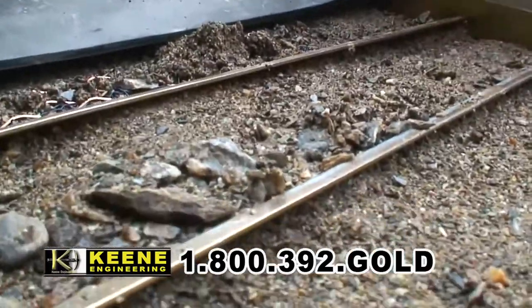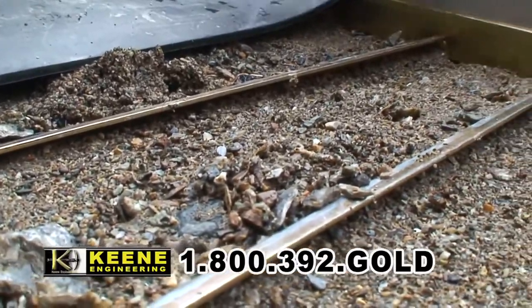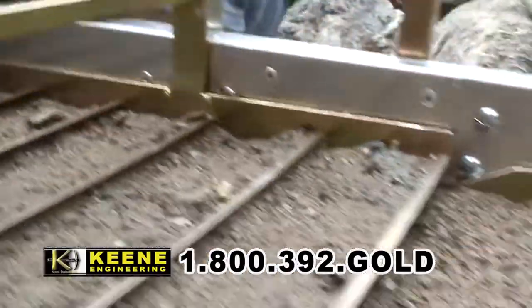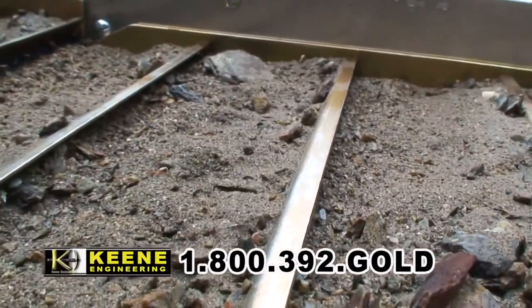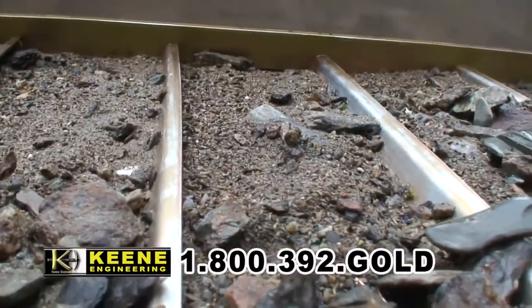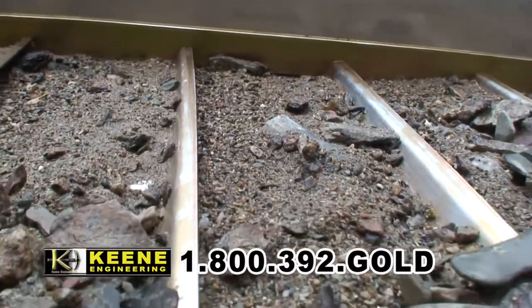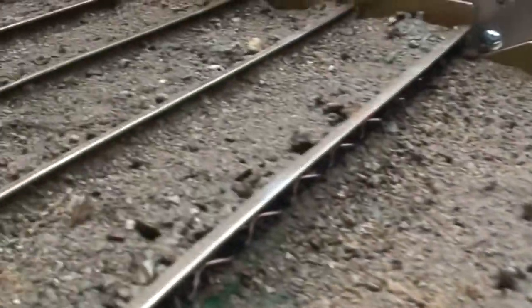That's about a half inch height riffle. We split it up with half inch and a couple of 3/4 inch. One thing we've found out is when you break up the flow, going from short to tall to short to tall, it actually helps the box work. From our experience and our testing, this is what we found out.